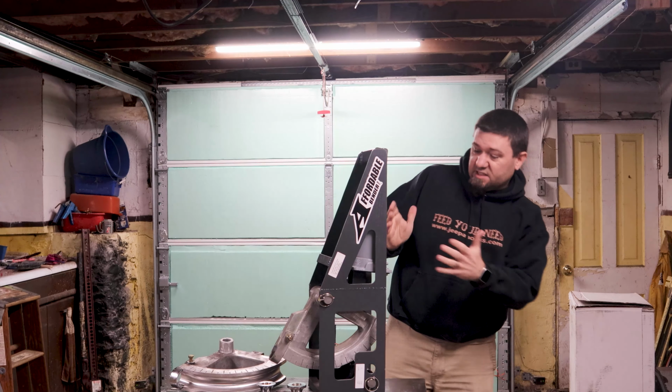So this is a 1¾ inch die, I think. Yeah, this is a 1¾ inch die for the affordable bender. This is a 1½ inch die. And this is a 1¼ inch die, right? Yes, 1¼ inches. You'll notice the bend radius on the 1¼ inch die is a lot tighter than on the 1¾ inch or the 1½ inch die. 1½ inches is the breaking point. At 1½ inches, you go up to a 7-inch bend radius. Below 1½ inches, at 1¼ inches, you have a 5-inch bend radius. That's just the way it is.